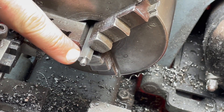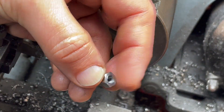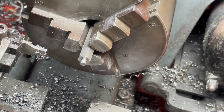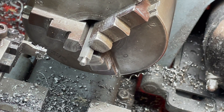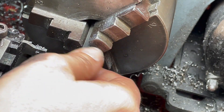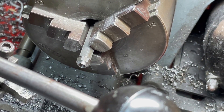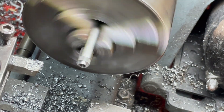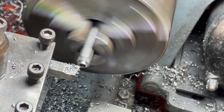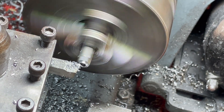I've turned up a tiny little arbor here because I need to face off and chamfer the back end of these nuts. The top end looks quite nice but the bottom end looks terrible. This is just using the die in the die holder threaded to 3/16 by 40. The nut screws on and then I should be able to use the various tools to tidy that up. After about the third one I got into quite a rhythm and managed to knock out the rest of the nuts pretty quickly.